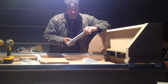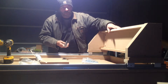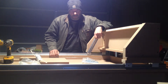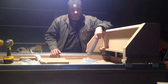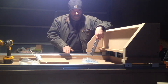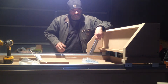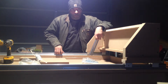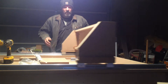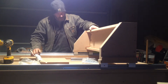When I purchased these, I ended up getting the 16mm. I was looking at 20mm, with 16mm for the X and the Z, and 20mm for the bed — the y-axis. But I figured the way I built this, I wasn't quite sure how much of a difference it was going to make. I was a little worried they might be too small, but with the weight going down on the rails being fully supported, I figured I should have no problem. I saved a little money with the smaller rails, and it moves extremely well. There doesn't appear to be any slop or play, so I'm pretty happy with it.